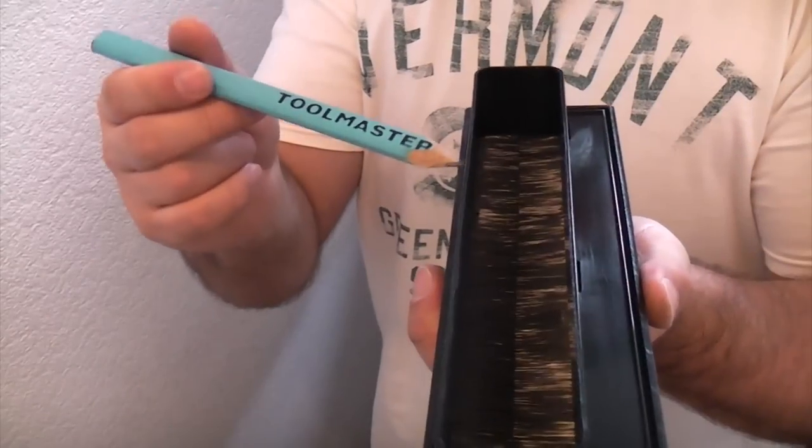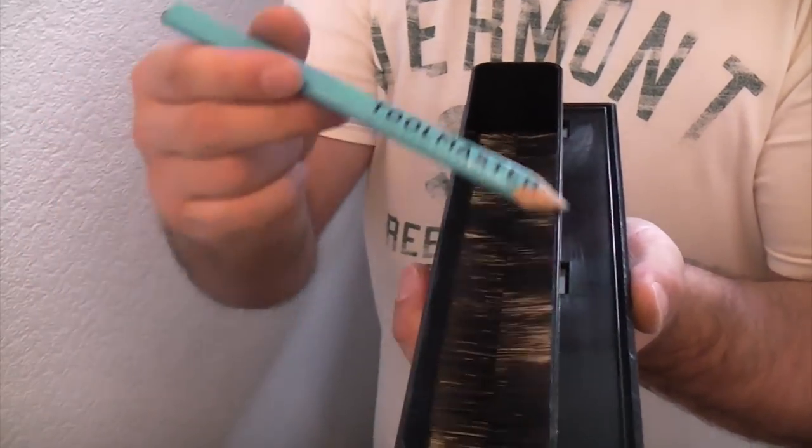So this one comes in two parts. The side with the gasket on is the outside part, and the bit with the brush on the inside is the inside bit. As you can see, the inside piece is the largest piece, so we need to cut a hole into the door the size of that sleeve.